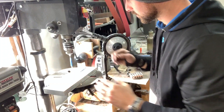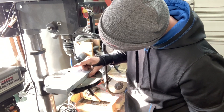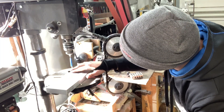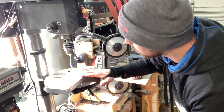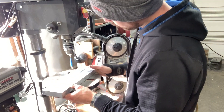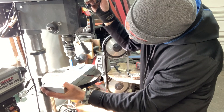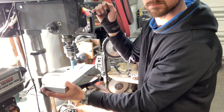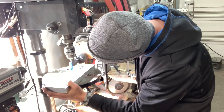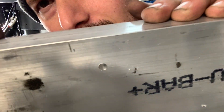Sorry about the sun shining through here on my drill press. What I did is put a little piece of tape on the bit to mark how far down I want to drill — obviously I don't want to go all the way through these plates, just down maybe three quarters of an inch or a little less. That's what I got my tape set at, so I'm ready to drill these.